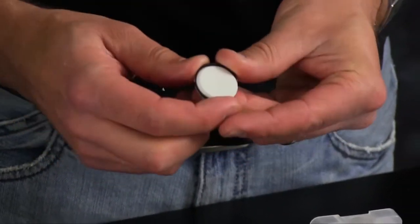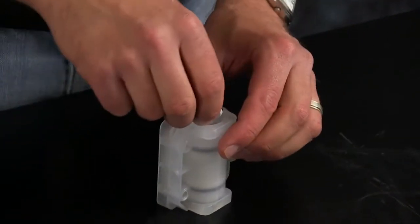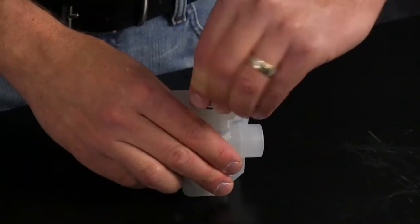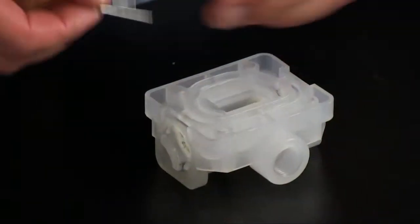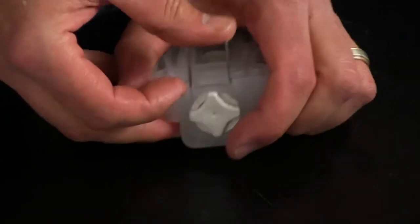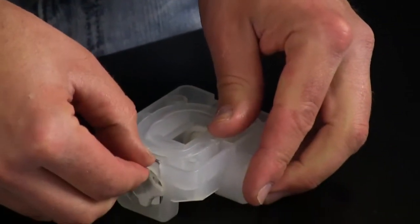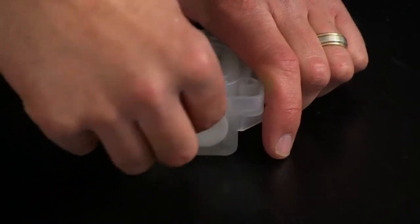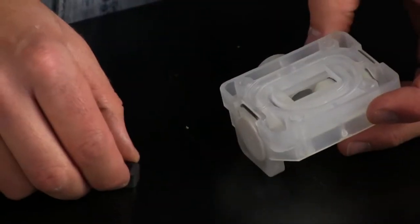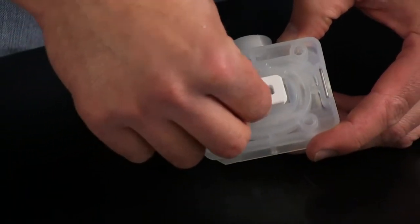Install the new O-ring on the end cap into the accepted O-ring groove. Apply grease to the O-ring to ensure we do not damage it during installation. Apply a little grease to the air valve body for ease of installation. If the end cap goes in too far, use the spool to push it back to set it. Be sure the end cap is flush with the air valve body. Alignment of the end cap is vital to the reinstallation of the air valve end cap retainers. Now we are going to install our valve diverter. Be sure that the cut portion of the valve diverter is facing towards the ceramic valve insert. Be sure we align all the porting on our air valve gasket with the air valve body.